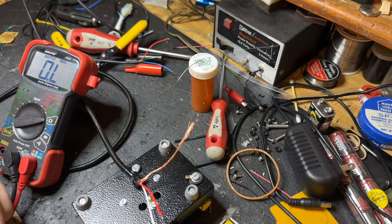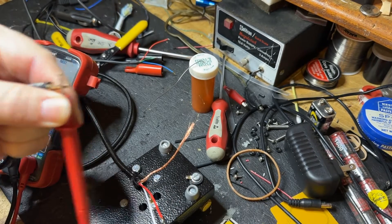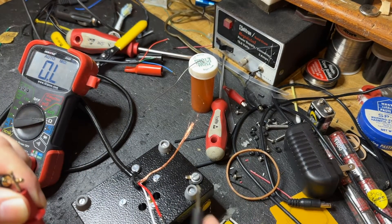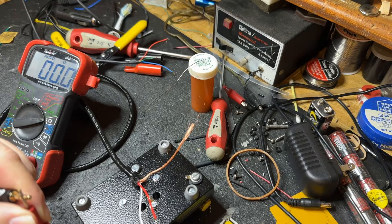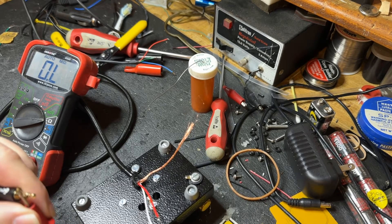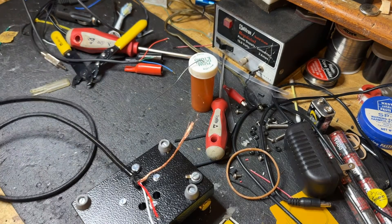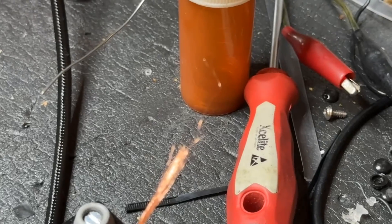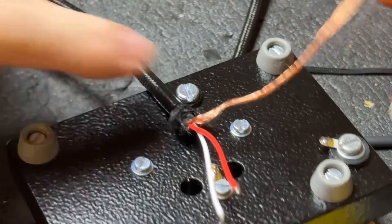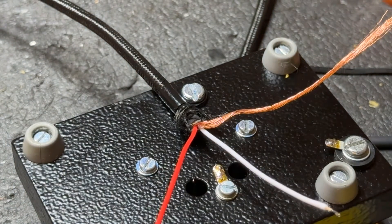So I'm putting this on the tip. There's the red on the tip. And now I'm going to touch this red wire. Well, wouldn't you know — it's the other way around. The tip is white and the ring is red. That's fine, and I'll tell you why. Because it just so happens that after I got this thing clamped in here, I discovered that the way the wires were oriented, it would make more sense for the white to go left and the red to go right. I was just going to flip it, but actually now I don't need to do that.